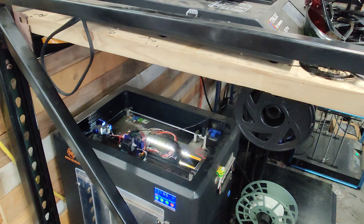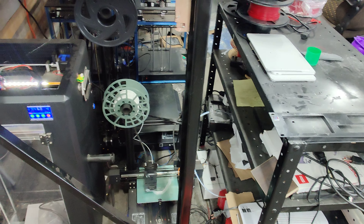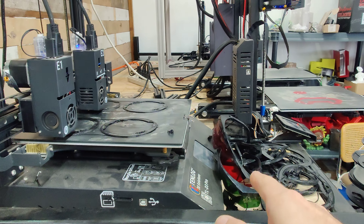It's not running too bad right now. I have an outer wall speed that's a little slow, but the print speed is at 100 — I think it was set to 80 in Cura — and I'm at 165-plus on the screen, just kind of stress testing and seeing how fast I can get it.